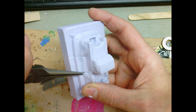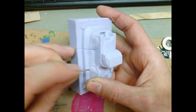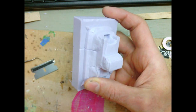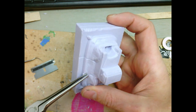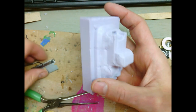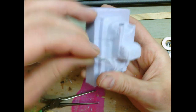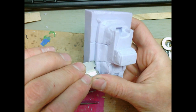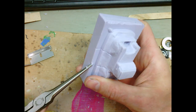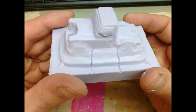There's the start of our channel, and that start is kind of the most important part. Now I'm going to channel it across this chunk of rubber here - v-groove it in, both sides, take that out. This will allow that resin and any air bubbles a place to go. I'm going to come down the wall here and do a similar groove along the top and the bottom, or whatever this surface is. Pull him out - pull him out. There we have a nice little zone for that plastic.